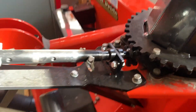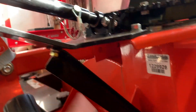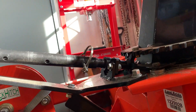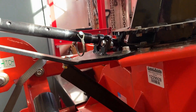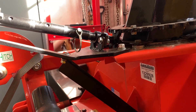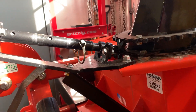You can see the way this is mounted — there is a bend in this, and then there is a piece of painted angle iron with an extension to bolt this up and support the chute. I don't think the angle has much to do with driving the larger gear with the pinion — it's more about a comfortable angle for the operator. Land Pride does sell both an electric and a hydraulic kit for this thing, but number one, it's expensive. Number two, it's nearly impossible to get from stock right now. But I like making stuff and figuring things out on my own.